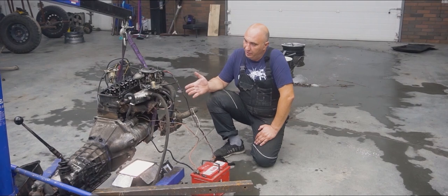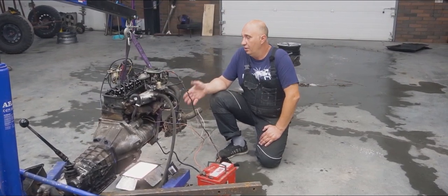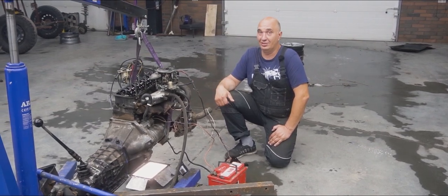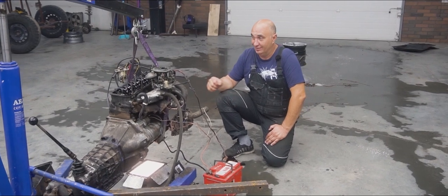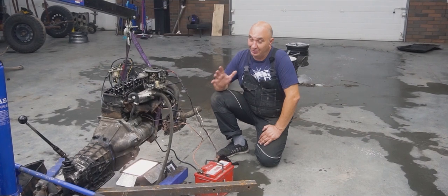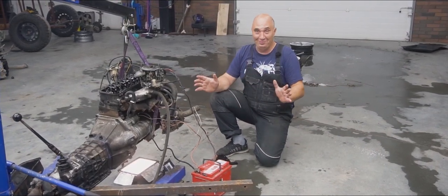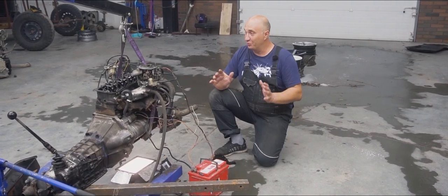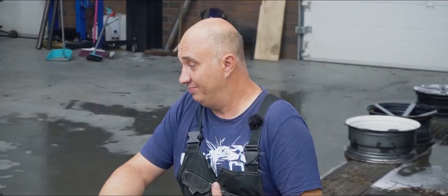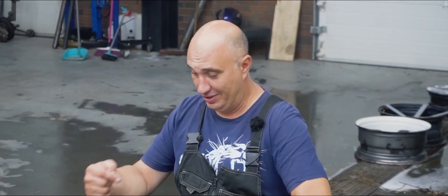So here's what we're looking at. We've suspended the motor. It's sitting in the position it's meant to be by nature. That wooden crank is in place. Though we did remove the chain, as we did the camshaft, to keep the valves from touching the pistons. And so now, with the engine under low stress, without the spark plugs, timing chain, without having to open the valves, let's get it rotating to check whether the crank will even keep it together. It might turn out too weak to push those pistons. I'm super curious to find out, so let's give it a try.